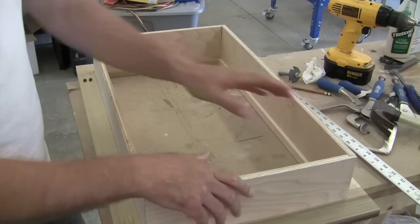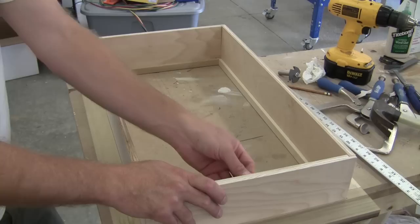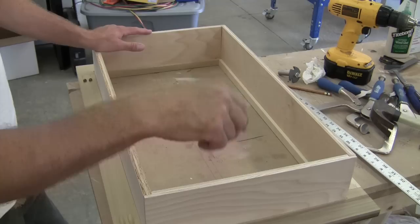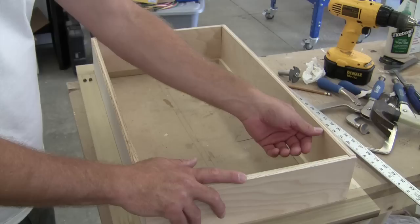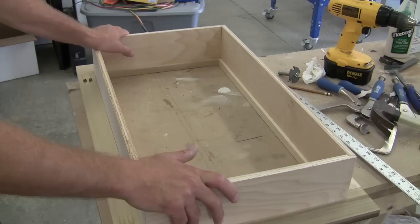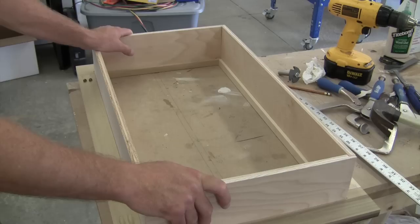If you can picture, once I do that there'll be a lip all the way around this perimeter, and then I'll cut a piece of half inch plywood and lay it in there. So I'll have a half inch rabbet all the way around, a piece of plywood will go in the inside of that, I'll glue it in, then hit it with an 18 gauge nailer. And if it works out just right, I won't be giving up any interior space because doing it the old way I would have given up a half inch anyway.